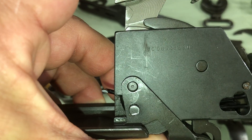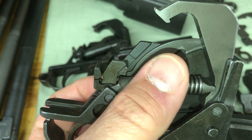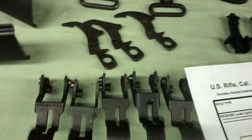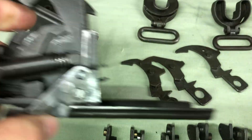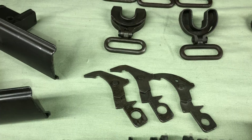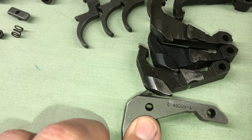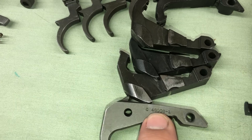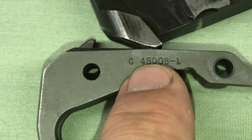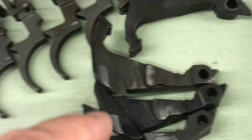Later stuff - we call this like a 65-series - was made to be a thin pad. The safety here has a curved top to it. These can have markings on the right or left-hand sides, and it has a hole in it. Some earlier safeties were flat-topped - like this Winchester, which is flat-topped and marked on the right side in the upper arm. Different markings for your safeties. For the hammers, they're asking about the early tooling hole. Be careful about how you put down the numbers - always do C with a space, maybe an underline, something bold. Write the numbers out; if there are gaps, put the gaps in. No gaps? Put them tight to each other, because it has different meanings.